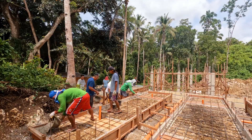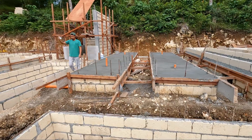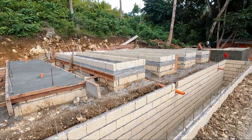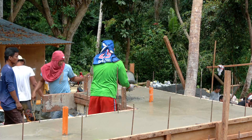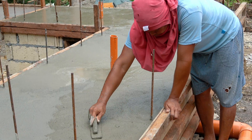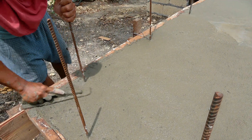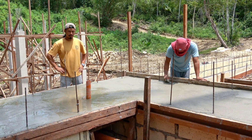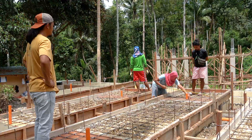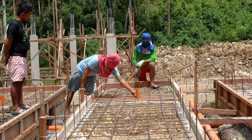We poured a foundation of concrete on the bottom first, then stacked hollow blocks around the perimeter with rebars bent to give it strength and integrity. This created a 20-by-4-foot box — the planters — about one foot deep. The plumbing will be set at about 12 inches and cut down to about 11 inches, sitting about one inch below the top of the planters for the rock line, creating enough space for all the rocks to fit. For each pond, we created five planters — the calculated estimate for drainage, water filtration, bacteria buildup, and a healthy aquaponic system.